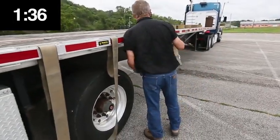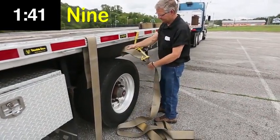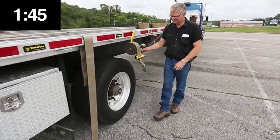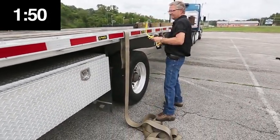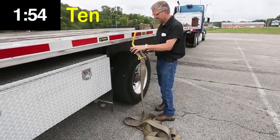When you're finished winding, you can grab 3 or 4 rolls at a time and put them in your side box. As you can see, the strap is guided through the Bumblebee, removing any twists so you end up with a nice, tight, neat roll every time. When operating your cordless drill on its low speed of about 500 RPMs, you can easily wind up 4 straps per minute.